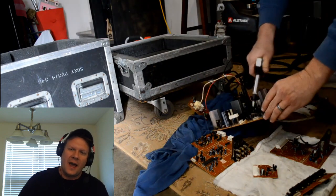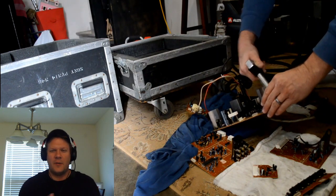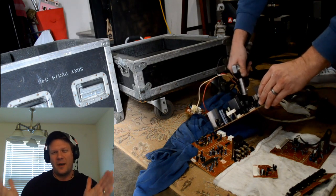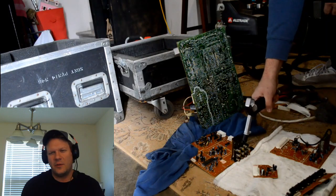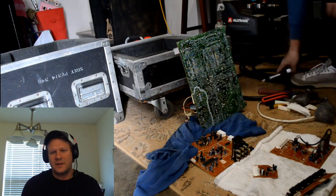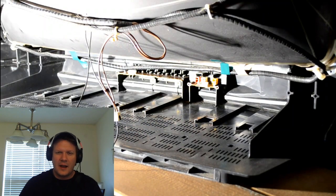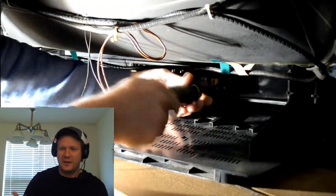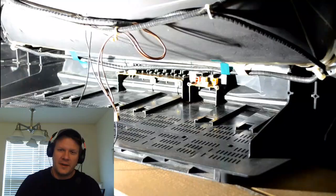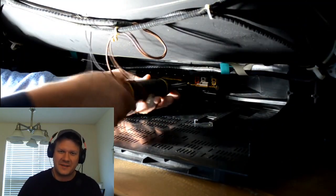So after I got all my alcohol cleaned up, again, a lot of that will evaporate, but it was sitting in it pretty heavily. So I still like to go through with my air compressor and blow off the boards again. And then I let them sit for a day. And after that, I start to reassemble the television, which is exciting because that means you're getting closer to actually seeing if this capacitor kit worked.